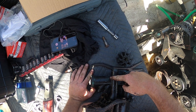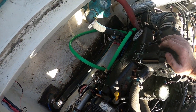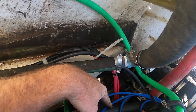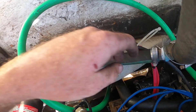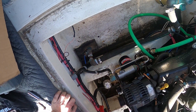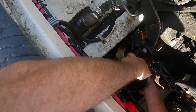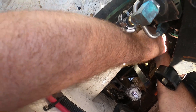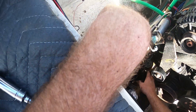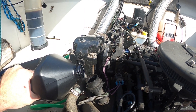The upper hose is your feed hose — it's suctioning from the intake. The lower hose is your exit to the engine. Look for the pipe that goes up and towards the engine — that's going to be your lower hose. It will be a soft hose, not a rigid hose, and very easy to squeeze. Start by reinserting the pump down in the bilge, bring the lower hose onto the pump barb, scoot it on as much as possible — all the way touching the drain port — then tighten down that hose clamp.